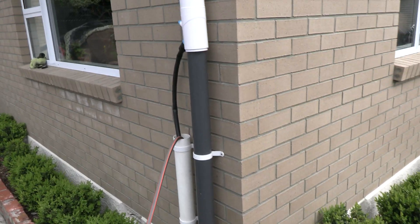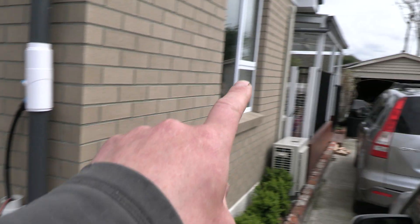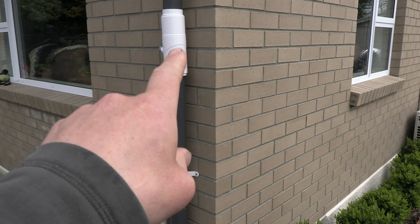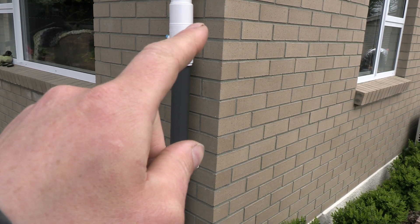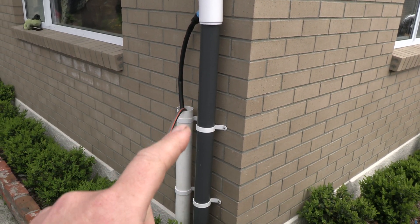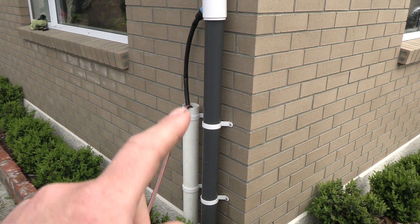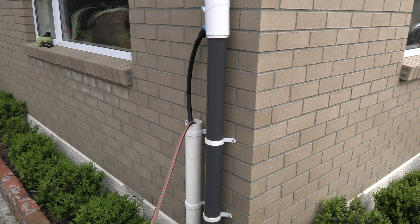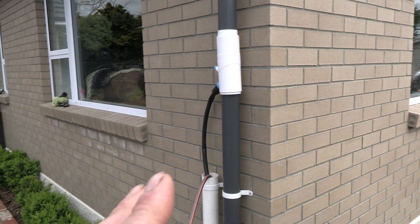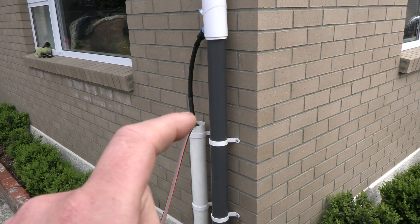For a little demonstration of my rainwater harvest system: each of my gutters around my house, each of my downpipes, have a rain collection harvester on it. When it rains, the water flows through the harvester into this pipe that I've cut down below it. The reason I've had to cut that pipe is because if I ran a single pipe straight from the harvester to the collection tank, there wouldn't be enough pressure in that water to push itself over to the rainwater tank.